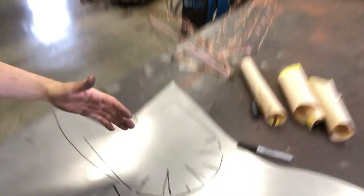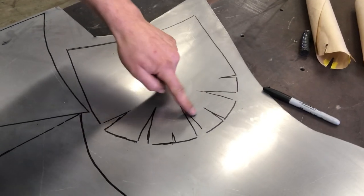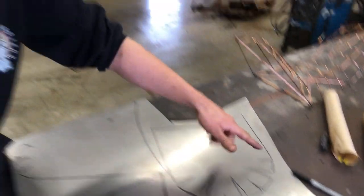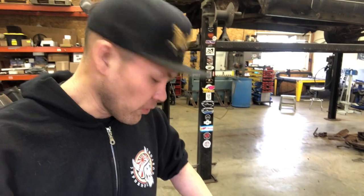So for this right here, I've got deep ones. So I'm gonna actually draw a circle there and a circle here, and I'm gonna make even marks so that I know that my shrinks are consistent, that I can count them. I'm gonna do however many deeps and then probably double shallower ones to create that stack. As a rule of thumb, there's almost twice as many in each layer as you go, but that obviously changes on whatever shape it is. So here we go. I'm gonna draw these out, cut these out, and we're gonna get to the power hammer.